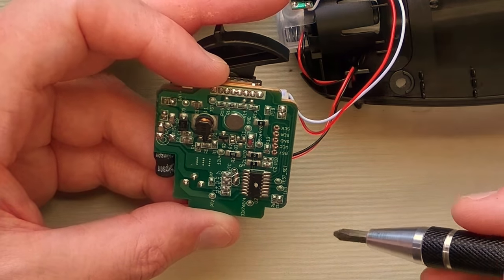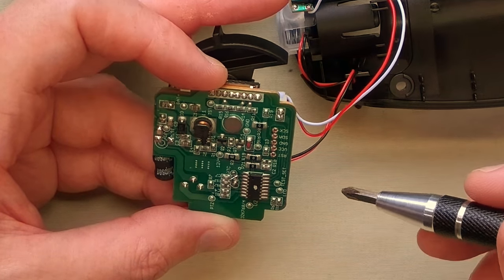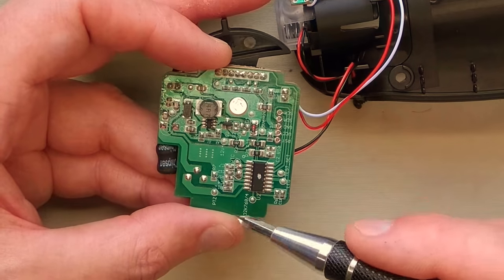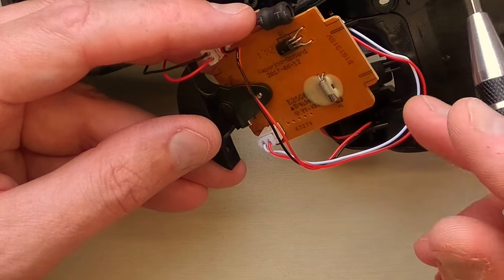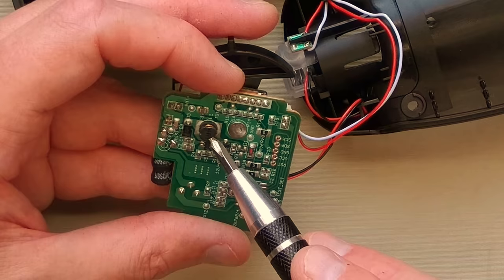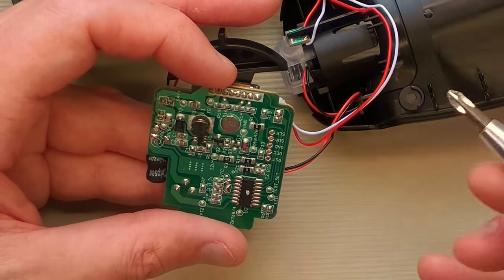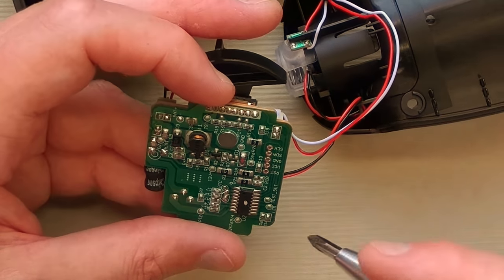Having said that, you think of the USB-powered ones that just have the little 8-pin chip that does everything. I get the feeling this is actually quite a complex circuit, but they may have reasons for that. This also has a quartz crystal in the back for timing, for that sort of daily on-and-off cycle. I wonder how much efficiency is lost in the converters, and what the standby current is. But when you've depleted the batteries and the aroma cartridge, you just put new batteries in usually.